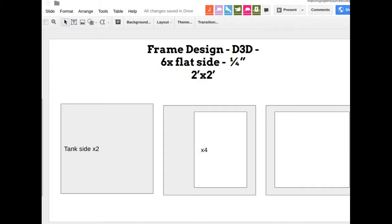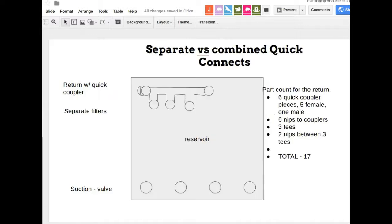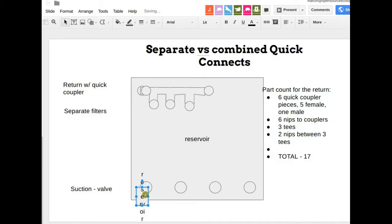the hydraulic reservoir. Now let's talk one more thing about the hydraulic reservoir. Our hydraulic reservoir also has to have a breather and a filler. So you need two more holes in it. So you got a little breather so air gets in and out, because if you don't have air inlet, then you'd get airlocks. Because the volume of hydraulic fluid changes, you're going to get either vacuum or pressure. So you need a breather,